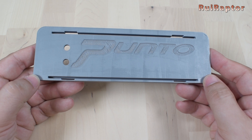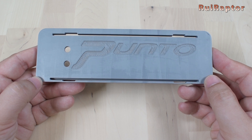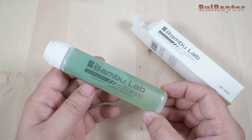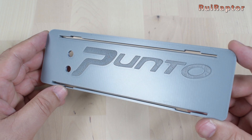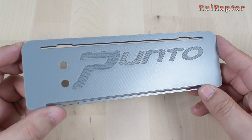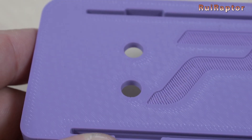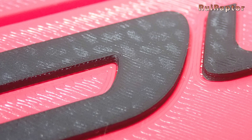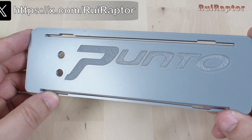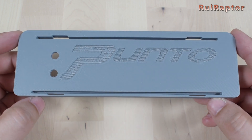With ASA, as we mentioned, it was the only one that we needed to use glue to print. It looks smooth as well, but we got the markings of the glue on it. We printed again with liquid glue but the result was the same. We then printed with adhesive spray, and this time the print came out smooth and without marks. One thing we noticed on all the prints are some light markings of the carbon fiber. These little spots are from the carbon fiber pattern of the build plate. The only one that didn't get these markings was the ASA print done with the adhesive spray, which acted like a barrier between the plate surface and the filament, preventing the spots from forming.